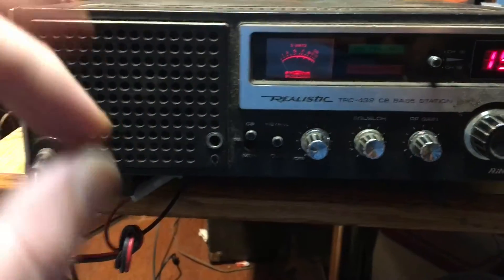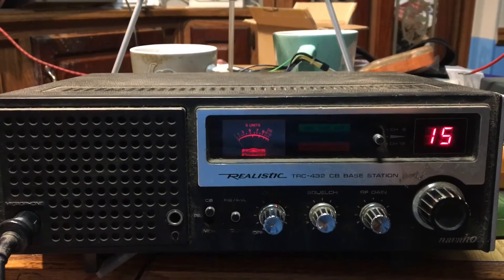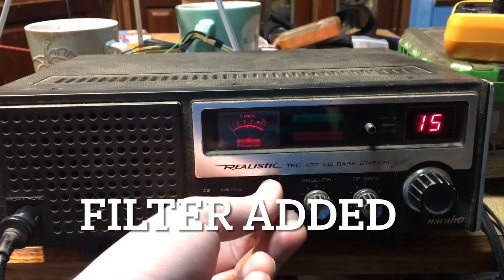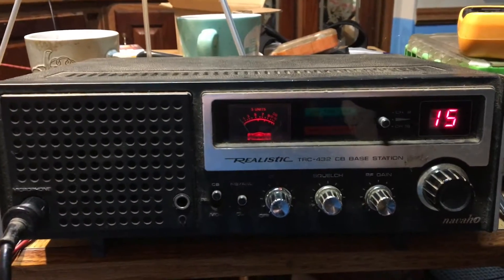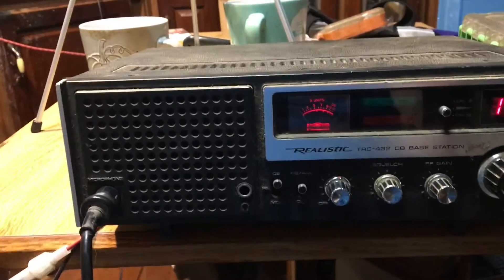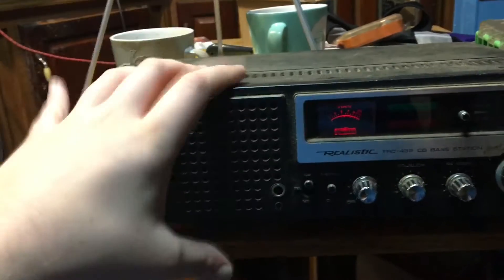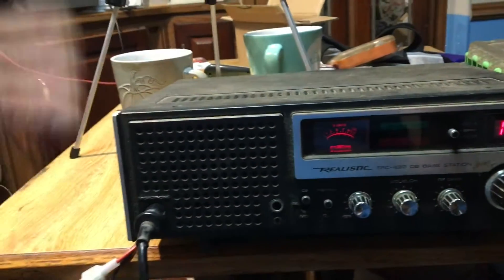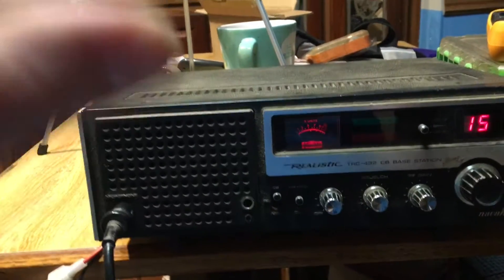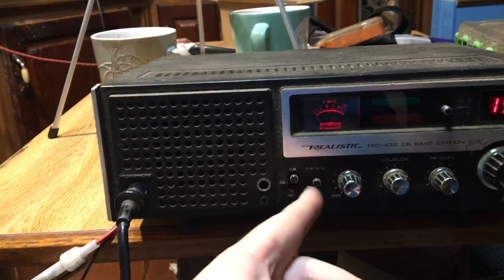Let's go ahead and see what we can figure out with this noise filter — hook it up. I'm going to place these side by side so you can tell the difference, if there's any, between the audio. This is with gain all the way up. That is a lot quieter. It's still sitting beside the power supply, but it's a lot quieter. I'm going to move the power supply further away from it and then see what it sounds like. This is after I moved it literally beside my foot under the table — much quieter. And yes, the further away you move it, the quieter it will be. You can use it without the noise filter if you want to — I have before, and you can still talk just fine on the radio. This is a special case — this radio is really terrible, really susceptible to noise. The caps are probably just dried out and bleeding. Most likely you won't have as much noise on your radio using the power supply without the filter.